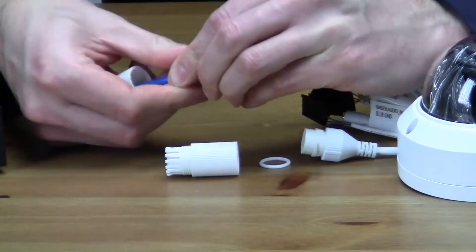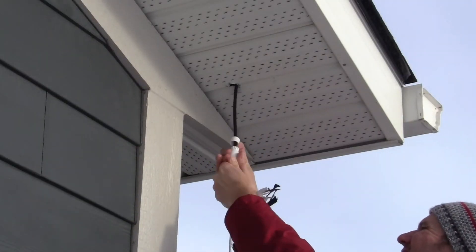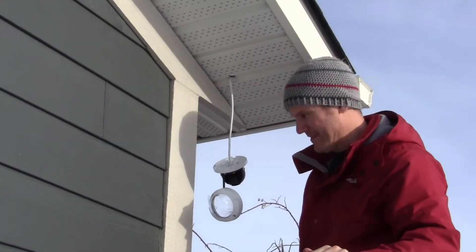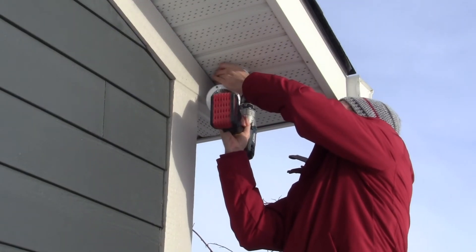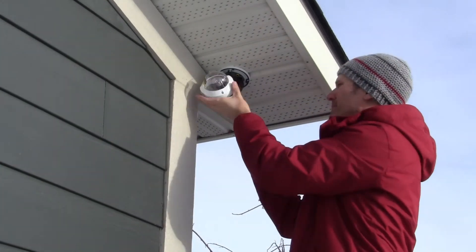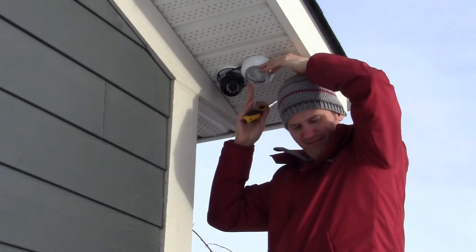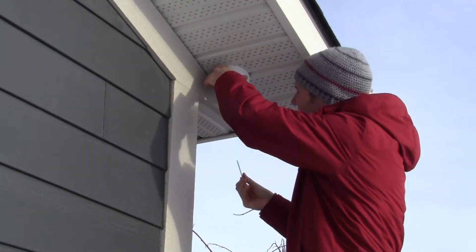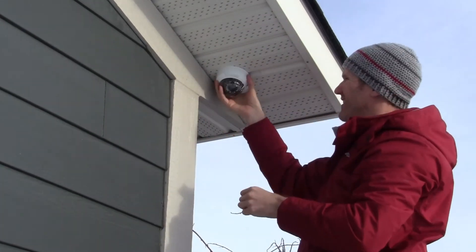Here's a quick look at how the coupler works when you already have your cable terminated. I quickly terminate the Cat6 cable, connect the camera, and secure the waterproof seal on the RJ45 plug. Now that the wires are all fed inside the soffit, I'll use two of my own screws to attach the camera — using three screws would have been more secure, but I don't want to remove and damage the soffit to install braces, so a two-screw install is my only option. Loosening the screws on the side of the camera lets you adjust the up and down point of view. I have my laptop on the ground so I can see exactly what area I'll be capturing. Once happy with the angle, secure the dome cover good and tight — and yeah, it's pretty secure.